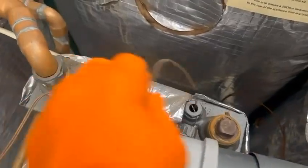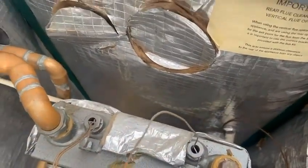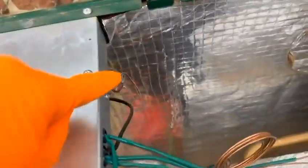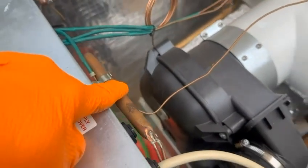You've got your stats here. You've got some that go into your pockets here, obviously your water pockets. Also on this, you've got an additional one, which is a flue stat here as well. I don't know if you can see that there, that goes in there. So if something overheats here, it tends to knock them out. And then finally you've got your final stat here, frost protection. There's your fire valve, correctly positioned in the right place.